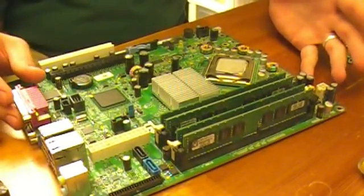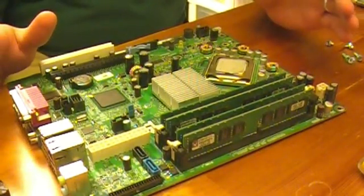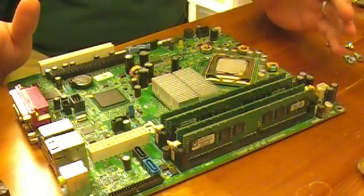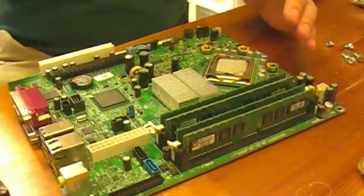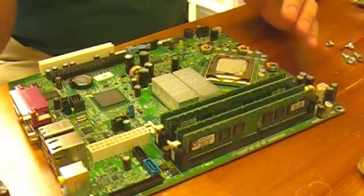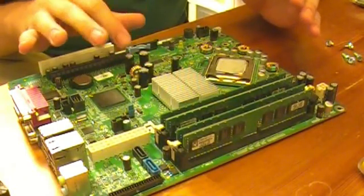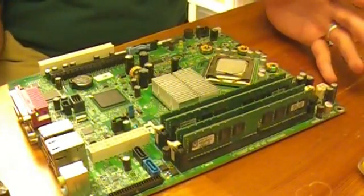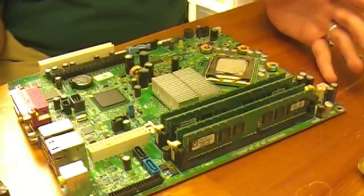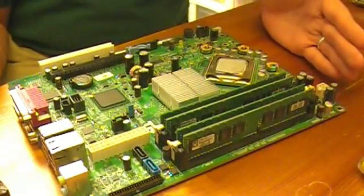It's when you run across the ones with Pentium Ds that are more prone to failures. Even the Pentium 4 hyper-threading machines that have the bad capacitors — those capacitors will fail. But from what I've seen, the ones with good capacitors and Pentium 4 hyper-threading normally have the capacitors survive longer, just because there's not as much heat. It may also have something to do with the hard drive — if it's running hotter, that can be a problem.